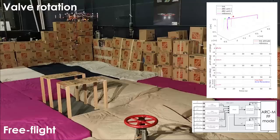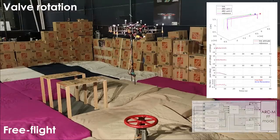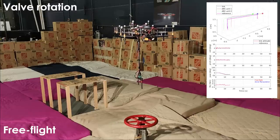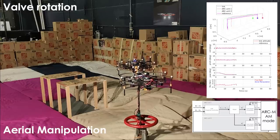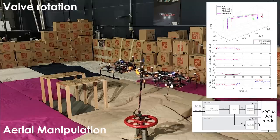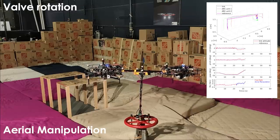In this paper, we propose the Aerial Robotic Chain Manipulator, or ARC-M, a system that presents the ability to exert significant torque compared to traditional MAV designs for forceful work-task execution. The proposed design consists of two micro-aerial vehicles, or ARC units, connected to each other through a rigid link and three degree-of-freedom joints. A finger end-effector is attached to the link connecting the two ARC units through a lightweight carbon fiber tube and a universal joint incorporating a stiff damper.